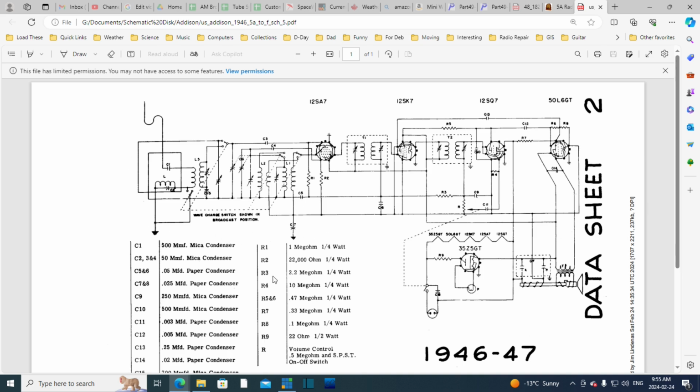So to stop these effects, you can put in a capacitor here. You could do this without a capacitor. If you just took a piece of wire and went from here, this is the B minus line here, and connected it directly to the metal chassis, then those interfering kind of things would stop. But now you've got another problem. Now the chassis is hooked up directly with a piece of wire to here, and guess what? If you trace this long enough, I'm not going to do it, you can probably find a way that this connects right back to the power line, right back to one of the prongs on the power line.